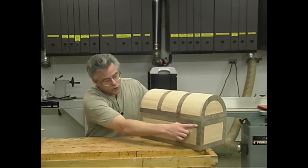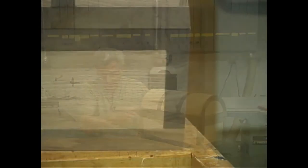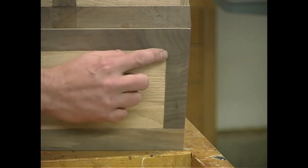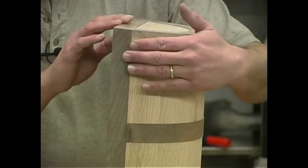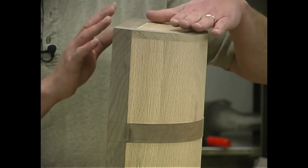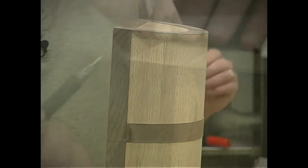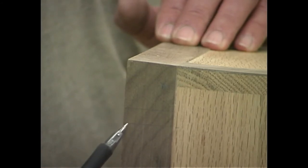Now we're getting up to a tricky part — there are two cuts that are a little bit tricky, but they're nothing more than a basic 3-degree miter cut. The process I followed: I placed my banding at the bottom and the top along the front and back edges, and then because these sides tilt out at that 3-degree angle, I had to fit these pieces in by mitering both the top and bottom edges to a 3-degree bevel cut. Because I was doing it at the table saw, it was a very easy cut. The bands that fit along the top around the curved surface present a few challenges, but it's really not that difficult. These are inch-and-a-quarter wide strips for the inside bands, cut to length and clamped in place. Two marks from each end on the top: the first mark is one and a quarter inches down, and the second mark is one and five-eighths inches down.